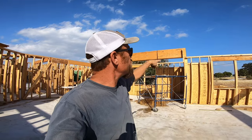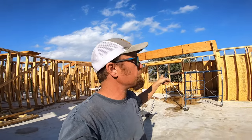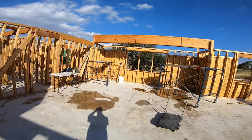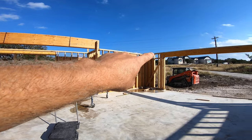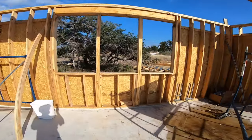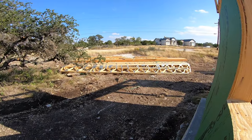So behind me you can see here we have four 1¾-inch by 24-inch tall LVLs. Each one of them weighs probably 300 to 400 pounds. I've got almost 4,500 pounds of trusses in entirety. Hanging off of that are going to be each one of our trusses, 16 inches on center. And then because that distance was too long even for a two-foot deep truss, tomorrow I'll get out here and we'll start laying out where those are going to go. These are our floor trusses, only for the garage.